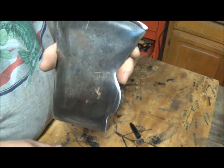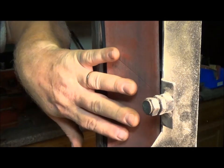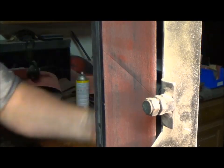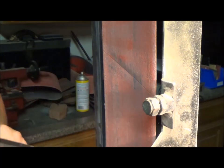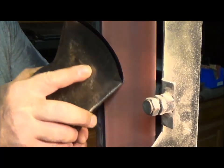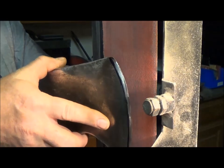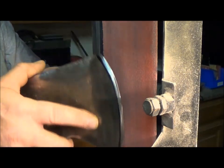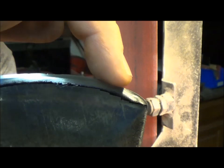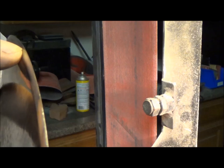That'll show me my wear patterns and my divots on the face of the blade. If you're wondering why I'm using the back, it's got a nice spring feel to it. If I were to use the face where it's intended to be used, it would just put gouges in the blade — that's not what I want, and it'll build up too much heat. I'm using this black line to show where I need to be at my low angle and my high angle. My high angle is going to be where my cutting edge is; my low angle is going to be blending in the rest of this metal, so you can see the gouges or the flat spots more readily.